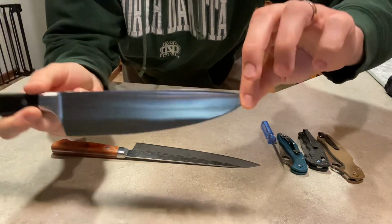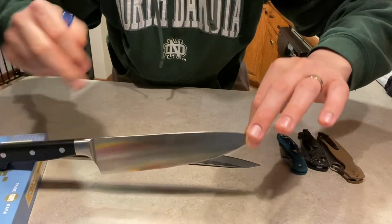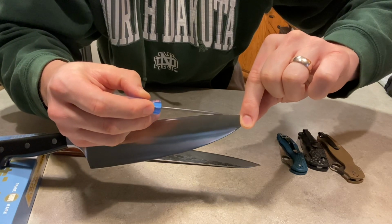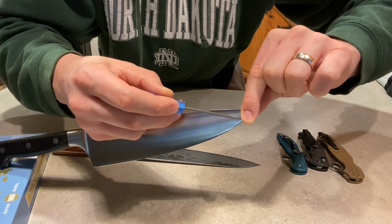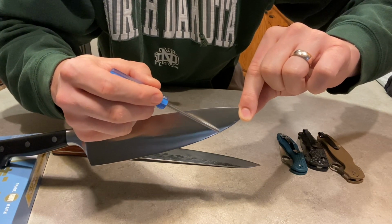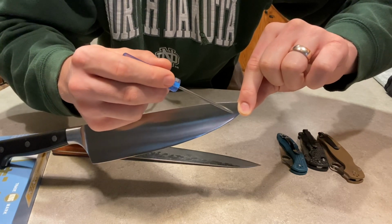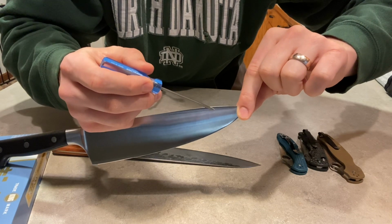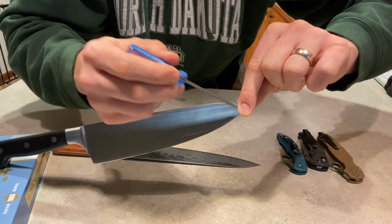And so let's just say your tip is broken off right there, all right? I don't have an extra hand, so bear with me here. So what I'm saying is if you broke it off like that, you could grind from the spine of your knife all the way down to the tippy tip right there, and you'd grind all of this off. That would be bringing your tip closer to in line with the edge. Alternatively, you could also grind all the way from maybe back here all the way up in a gentle slope, trying to match that same rocking geometry all the way up to the tip. And the third option, which I'm doing out of order, so forgive me, would be starting here and going to the middle, and then starting down here at the bottom and going to the middle, and kind of matching what was original.